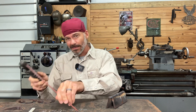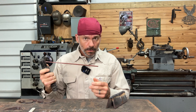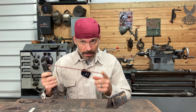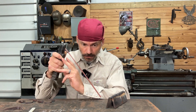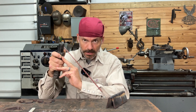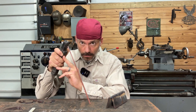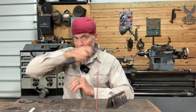Have you seen people weld and stick, and they try to pull it off? That's going to damage the end of your rod. Here's a quick tip: if you've got a fresh rod going and it sticks, as soon as you feel it get stuck — break it off fast. I'm serious. As soon as you feel it almost get stuck, pop it off right away.